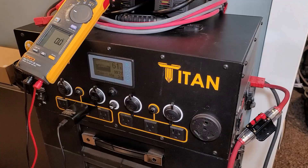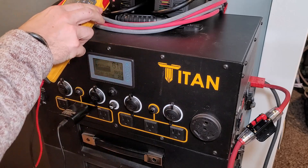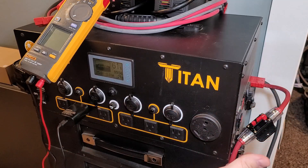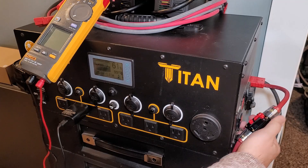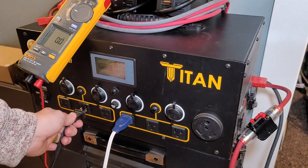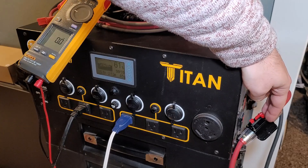I'm going to turn these off and try to equalize the batteries a bit. The breaker had popped but it's engaged right now — 25.6 volts there, 26 volts now, so it is equalizing a little bit. I'm going to let this cool off. It might just be that after nearly two hours at about 17 amps of current, it just warmed up and this breaker is the issue. This block here is definitely warm. I have a fan blowing on it. The breaker has remained engaged and is cool.